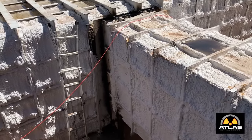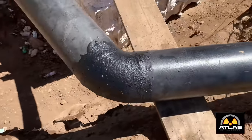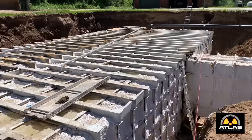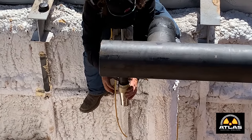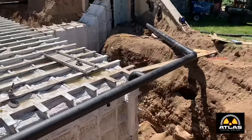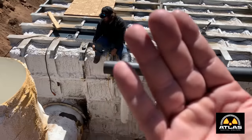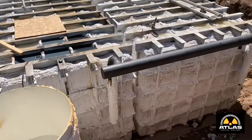So it's got a roof tar on that as well as the pipe. This corner we did with a 45 degree elbow, completely tarred. All the welds are tarred, everything's tarred. Now we're going to get ready to spray some foam in a little bit. He's screwing on the check valve with a screen on it. This is so when the air comes in the main pipe and condensation builds up, it has a place to let out the condensation. The check valve means water can come out but water can't come back up inside it. That will be on the end of every pipe to keep condensation out of the stair pipe. Now we're tarring between the bunkers.